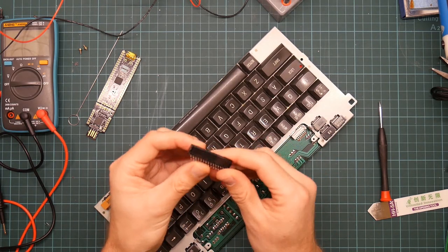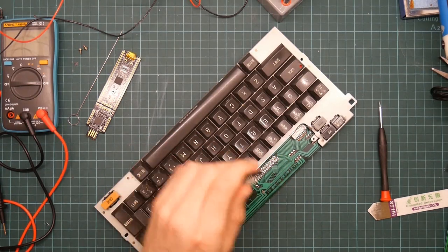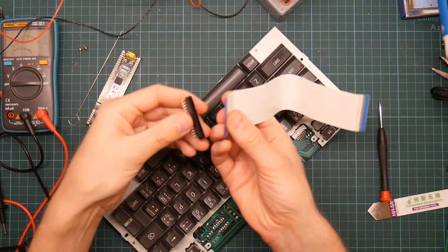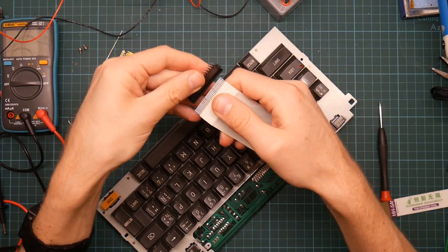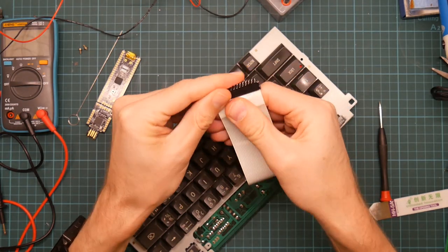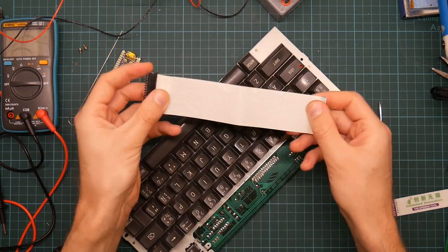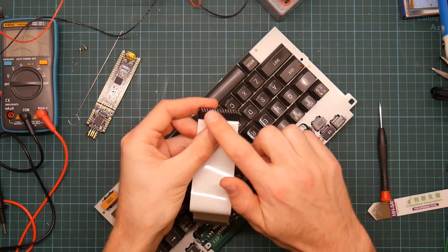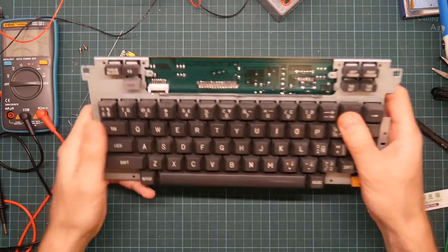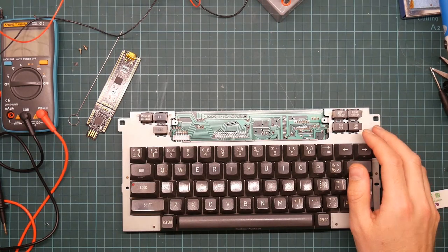But worth having. So this is the ribbon connector that it actually works in. This is actually still good enough to use, should I ever need to get 30 wires from one PCB to another with this terrible staggered pin spacing, which is extremely unfriendly to 0.1 inch components.